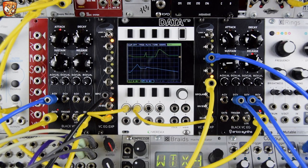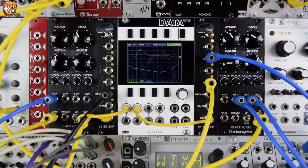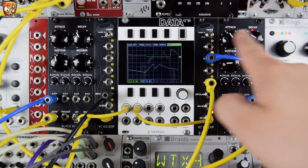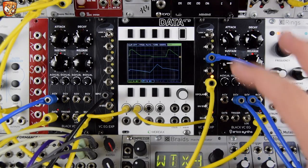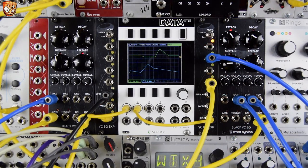The bipolar output is changing the tone of the bass, with the main out controlling its VCA. The third sound is triggered by the decay — the logic output on the expander hitting the decay stage triggers another envelope, which is a simple AD. Because we've got CV over these time stages, this is very interactive. So this looping envelope LFO, as seen earlier in the video, is the whole timing mechanism for the patch — controlling when the bass comes in and re-triggering this third panning sound. It's the whole patch.